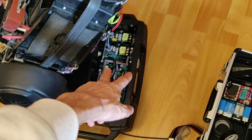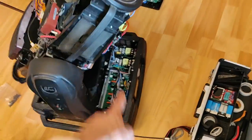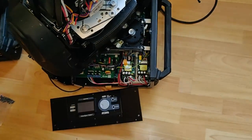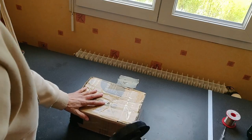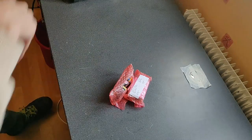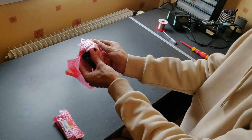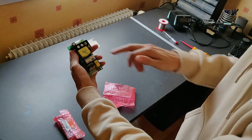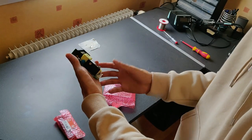On both units the power supplies need to be replaced, and there's a little cleanup of the optics to do. Thankfully the power supplies are very easy to access — just remove the cover and you can change them on the go. The customer got me replacement parts. This is all the power supply here: switching mode, bridge rectifier, smoothing, switching transformer, smoothing on the output, and out. Very simple design. Now I need to get those on the bench.